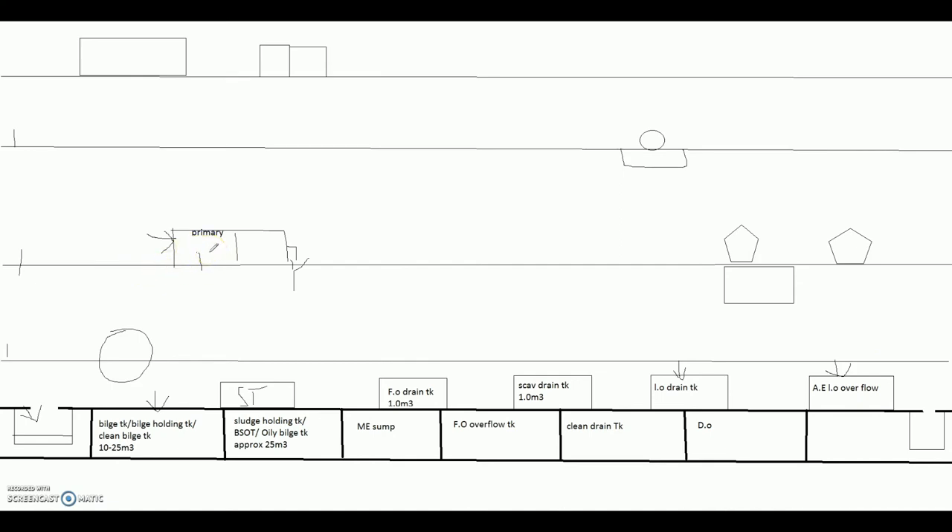Once you transfer, it has to settle for some time. What the primary bilge tank does is settle solid particles — mud, sand — and also help in oil separation. It has a heating coil so oil traces get separated, drained, and transferred to the bilge holding tank, then discharged through OWS. You run the OWS once or twice a month. When the quantity is above 4 cubic meters, you will transfer depending upon the route, port proximity, or tank fullness.